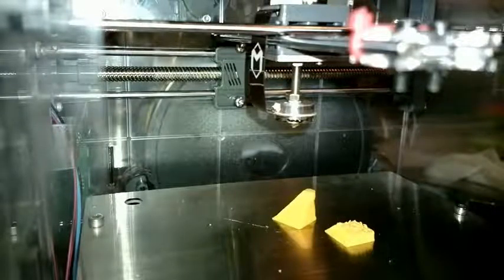So the thing is, that collar has fairly sharp square edges on it, and there was an idea posted on the Makibox website that maybe the notches cut in the filament by the filament feed motor are actually catching on that edge, which would mean that obviously then can't feed filament in and the whole thing jams up. And quite apart from that, when you first feed filament in, the end of the filament definitely catches on that edge, and it makes it a pain in the neck to get the filament in.